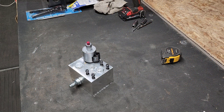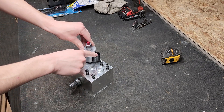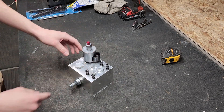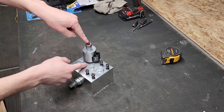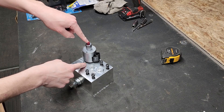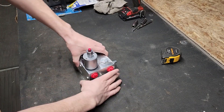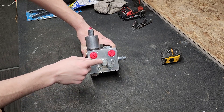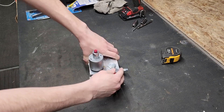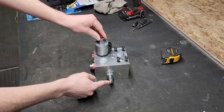This is the GX5 PWM — the only version we have, used in all the hydraulic pumps we offer. The two-pin PWM plug goes into this port. This is your solenoid. The red button that goes through the PWM is your manual override. On the backside, P is your inlet, T is your outlet. This is a pressure compensation valve, and this is your bypass valve.